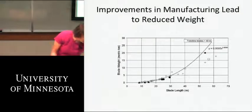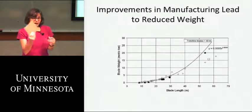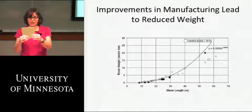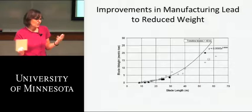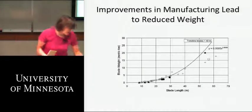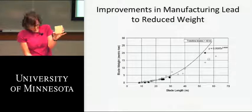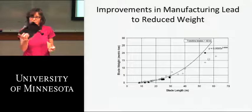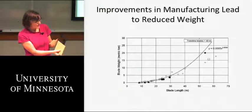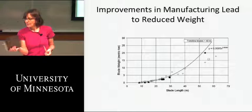All right, so I'll pass out. Here's a very dense glass fiber composite. If you look at it, you'll see some black things in there. That's because we, at one point, were embedding strain gauges or something like this, and we were looking at that. Here's another one. I'll pass this to you. So all of these three that are nice, smooth surface finishes and look kind of, you can't see anything, are all unidirectional prepreg composites.